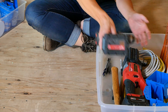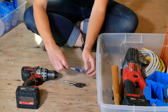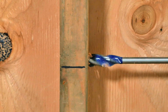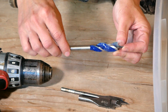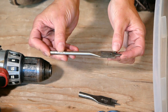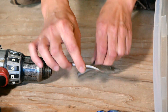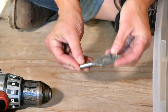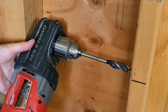First up I've got a standard 18-volt cordless drill for drilling my wiring runs, and to go with that I've got a couple different kinds of drill bits. First I've got an auger bit — it's got a special tip that helps pull the bit really rapidly through wood. You won't see this in fine woodworking because it makes a messy hole, but it's really great for just chewing through your studs. If you don't want to get an auger bit, another option is a spade bit, which will make the holes just fine but you'll be working a bit harder. The nice thing about spade bits is that if you've got a really narrow space between studs, you can knock them down with an angle grinder and make yourself a little mini bit — this lets you get inside a stud bay as small as 10 inches, which could save you from having to get a right-angle drill.